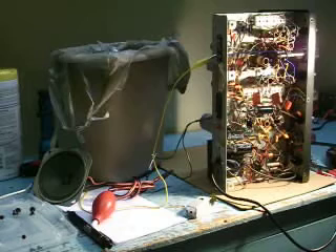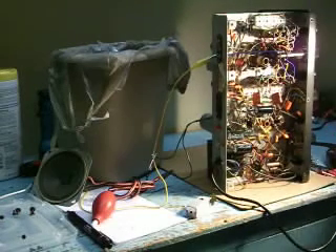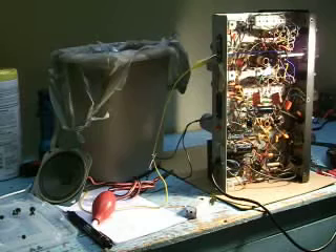Put it all back together, it sounded great. I went and did a quick alignment on it and it sounded great. But every once in a while there would be a snap, pop, crackling. I went through it again, cleaned all the controls, ended up replacing the volume pot because it was a little touchy. Looked at everything possible, cleaned the tubes and tube sockets. And what it came down to is this — noisy IF cans.